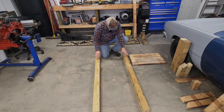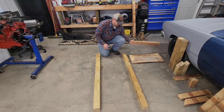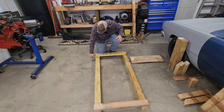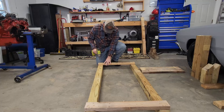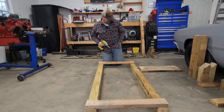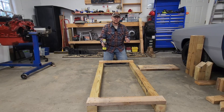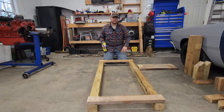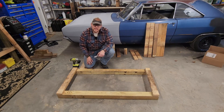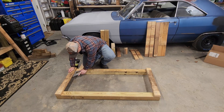For the first stage we're going to want our two 60-inch 4x4s and five of our 28-inch 2x4s. I'm going to take and lay one 2x4 on each end and measure across so I want my 4x4s to be 28 inches. I'll go ahead and drive in one of my three inch screws on each side. Only driving one screw in will let me shift these back and forth so I can measure corner to corner and make sure it's square. I can take a carpenter square and get a general idea, and I can already see it's off a bit.